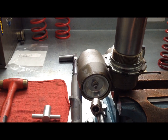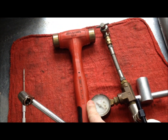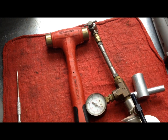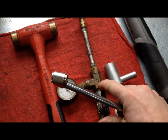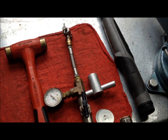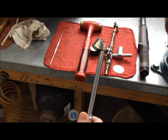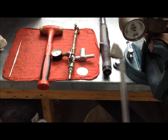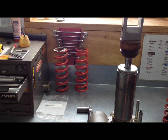Now let's go ahead and put some nitrogen in it. This is another myth — a lot of people think you need this special setup right here. It's got dust on it because it's been sitting for a while, because you don't actually need it. This tool opens the Schrader valve so you can close off your nitrogen pressure and then open the Schrader valve back up without releasing all your nitrogen. But you don't need that. With just a simple tire valve, if you do it right, you won't lose any nitrogen — same thing as putting air in your tire.